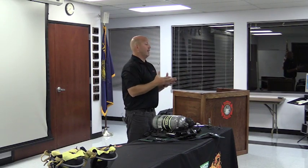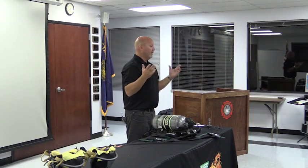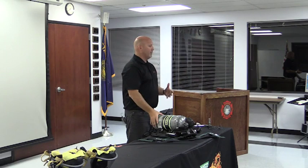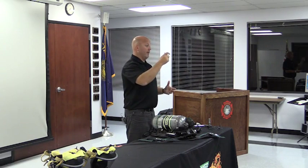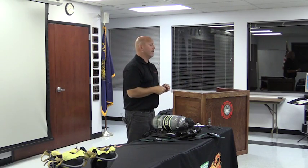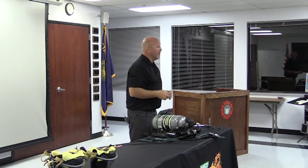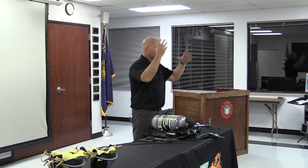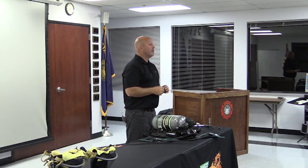So let's just pose the question a different way. I'm at a structure fire, mutual aid. I run out of my high pressure cylinders, and all I have is low pressure cylinders. What am I going to do? Spin an adapter onto that low pressure cylinder, put it into my SCBA. Where did we say the low air alarm is going to go off on this SCBA? 33, which we said, I don't know if anybody did the math to check me, but between 1450 and 1500, right in there. Low pressure cylinder is 2216. A couple chugs and you're out, right?